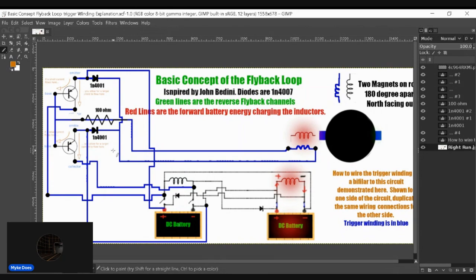And if it becomes a problem, you can always trigger this circuit without a trigger point. In the meantime, I'm going to ignore that issue, while at the same time I'll try to find a workaround. I honestly don't see one, though, because I thought about putting a diode here to stop this positive flyback signal from reaching the negative side.